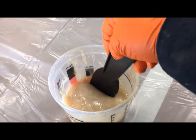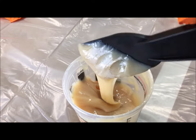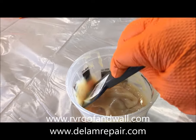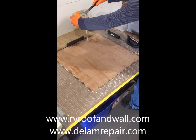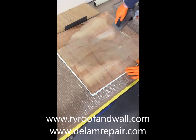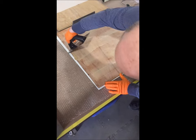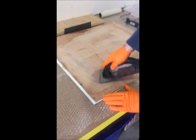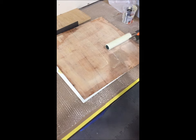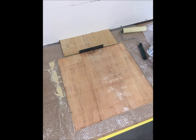Then we take a roller and apply pressure to evenly compress the two surfaces together and spread the adhesive evenly. The next step is to mix the Composet Compobond epoxy resin, a much thicker viscosity material. The Compobond is dispensed onto the plywood surface much like the SLV, then spread out with the flat edge of the steel trowel to begin building an even consistency. A roller can be used after this — though it's a little stickier, it will help spread the adhesive and build an even film. Follow up the roller with the steel notched trowel to create the flat profile.